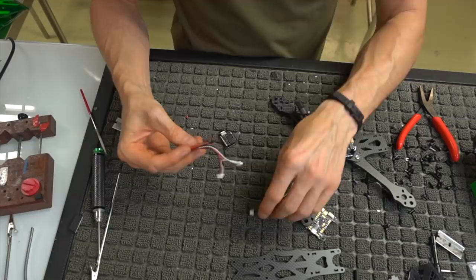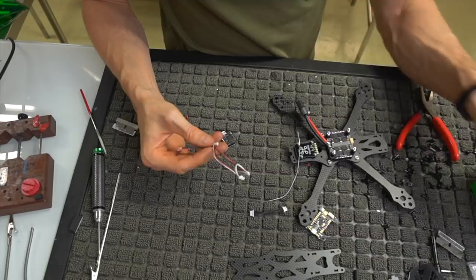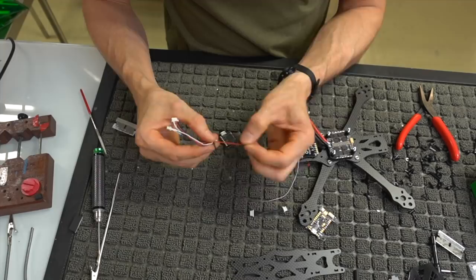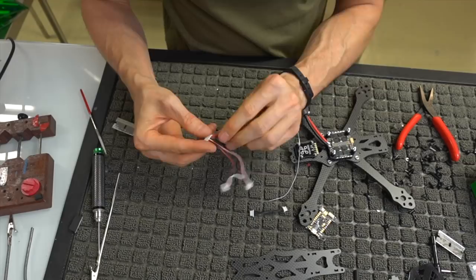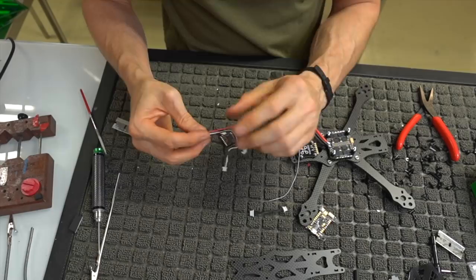So when we talk about your video and your actual wiring harness itself, you have these two wires. In theory, there would be one wire here, but since the wires are so thin, Sean thought it would be a good idea to go ahead and double up, because this is powering your video transmitter and your camera and all that. So we can take these two ground and power wires and twist them together, because we are going to be using them as one.